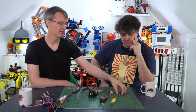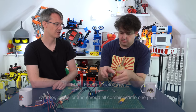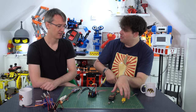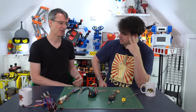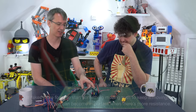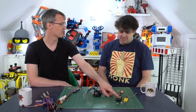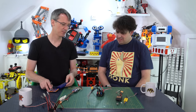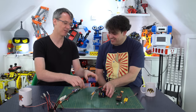These two are drone ESCs - 30 amp and 90 amps. We've got the RC signal in, power from the battery, and the motor out. The difference between drone ESCs and car ESCs: a drone rotor is just spinning in air with not much resistance, so startup torque isn't critical. The car ones are much better at startup torque because the motor drives wheels with friction against the ground. Drone ESCs also tend to only go forwards - they don't have reverse - whereas car ESCs have more options. You can configure them by programming card, setting things like cutoff voltage and how many S your battery is.